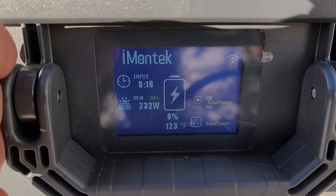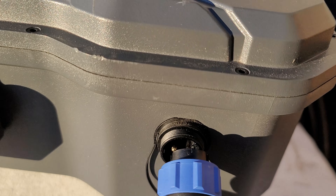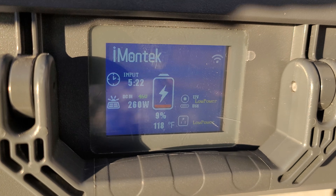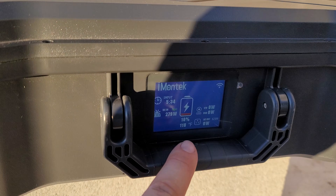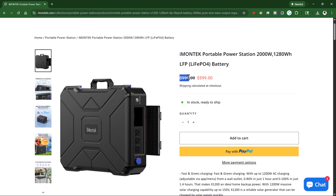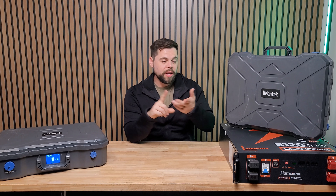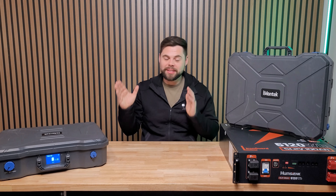Dark start is when this runs down to zero or five percent — whatever you set as the bottom of the state of charge. By nine or ten in the morning, when the solar panels are recharging and the battery gets to 10 or 20% — whatever you've set — it will automatically turn the outlets back on. If I'm not home, this will continue running my fridge or whatever appliance is plugged in, completely automated, without needing Wi-Fi or an app. And the real kicker is the price — this thing is only $600 for a basically 2,500-watt inverter, 1,300 watt-hours of battery capacity, 1,200 watts of solar, dark start, and the ability to put two together for split-phase power.